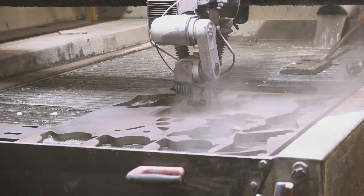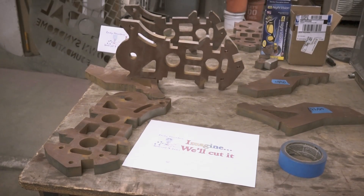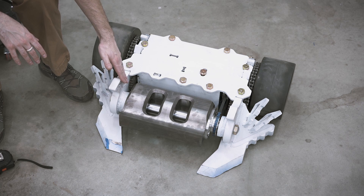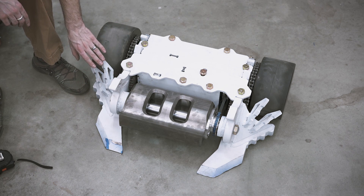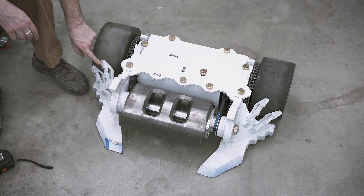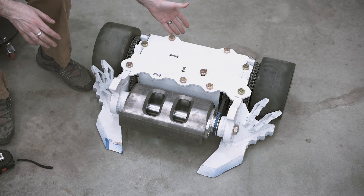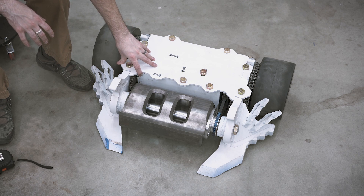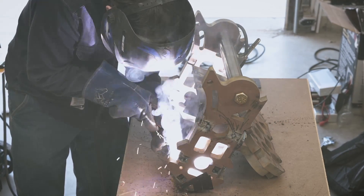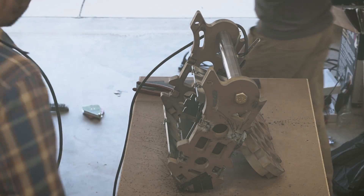If you're looking to get anything water jet cut, Rocky Mountain Water Jet is great — they do smaller jobs, understand combat robots, and really get excited about it. All of these parts were water jet cut, which is the most economical way to cut something like this. We also have side gussets with fins — those are one part decoration, but mainly to protect against things coming up into the wheels. These are half-inch AR450, so still pretty strong structural elements. The top plate and the rest of the pan are all made out of quarter-inch AR450 — quarter inch is what a lot of people use for armor, so the fact that that's just our top plate and inner tray explains why this robot is so small. There is a significant amount of steel on here, and the one inch sides are really the main structure.